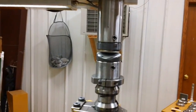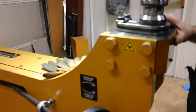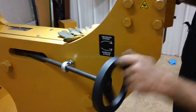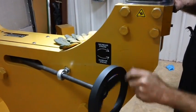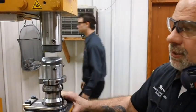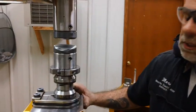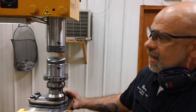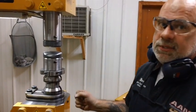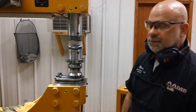Also this machine is very controllable — you can go all the way down to just a minimal sort of tapping, which is like for planishing. It's very slow, very easy. Then you can crank it up, like if you are doing a stack of panels you can bring it all the way up, and now if you hit it, it makes your ears ring. It definitely puts down a lot of hit, and we use something like that if you are putting two, three, or four panels together and shaping them at the same time. The max setting is really only designed for that specific need.